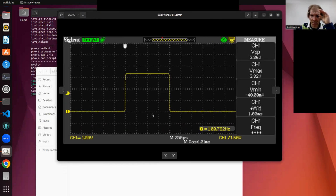we can see that on your oscilloscope, the width of each square is 250 microseconds. And so what that tells us, based on how the pulse is framed, is this is perfect. We can see that when it's full backwards, the servo pulse to drive that is 1,000 microseconds. It says right here, 1.0. That's perfect. This is micros, 250 microseconds, 4 times that is 1 millisecond, okay.